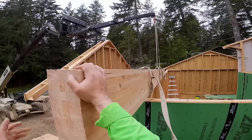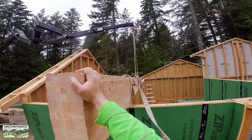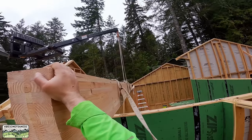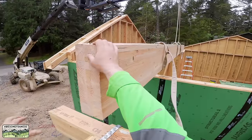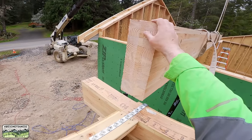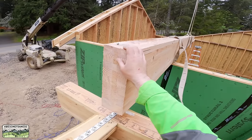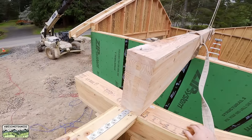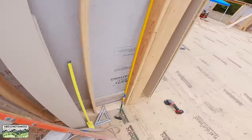Okay, so the backstory on this. Last February, we made an upgrade to the forklift. We put the Sidewinder swing carriage on. So now the forks can swivel 90 degrees to the left, 90 degrees to the right. However, they're connected by these two auxiliary hydraulic ports that have no feathering ability. So when you just tap the button, that's what happens. Anyway, that combined with the truss jib has made our life much simpler. The trick, by the way, if you want to feather that control, is boom out or in, so you kind of split the pressure on the hydraulics.